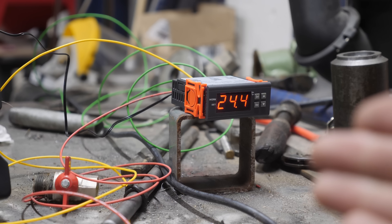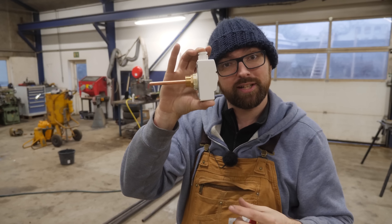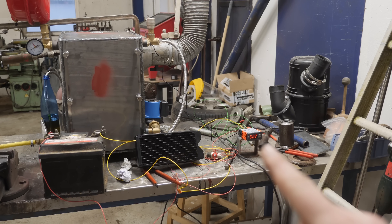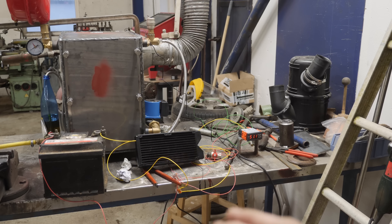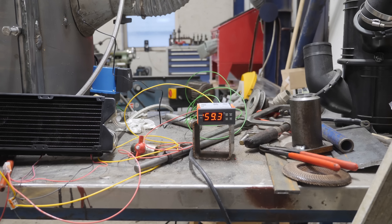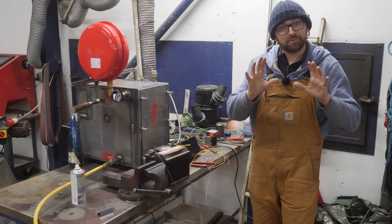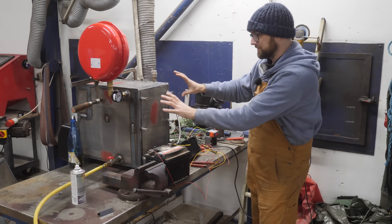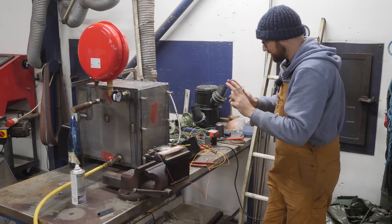This is the water temperature inside of the boiler and as you can see it's going up and up. There are a couple of important safety features missing from my simplified setup — there's the pressure relief valve and also this doohickey which cuts off power to the burner if the water temperature gets above a set level. The little number you see climbing is simply a thermostat, not a safety device — its job is just to make sure the water temperature inside the boiler sits around 60 to 65 degrees Celsius. Once we reach 60 degrees Celsius the burner should turn off — and there we go. The burner is now off; don't mind this little bit of smoke from some temporary insulation that wasn't really suited for this purpose.